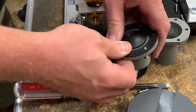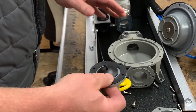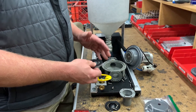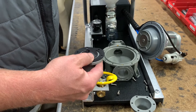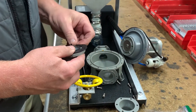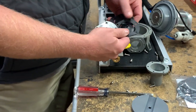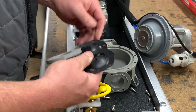The rear inlet — same thing — screws out, don't lose them. If you do lose any screws, hardware gets stripped, or you need any part of these pumps or the air pump, we have every single piece and part you'll ever need. On the website, when you click on the pump, there are owner's manuals that list every part diagram and piece we sell. So throw the old flapper valves away — you've got your two new flapper valves. Make sure there's no dry grout inside the pump body — clean it up.